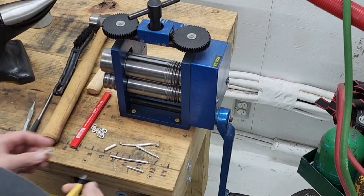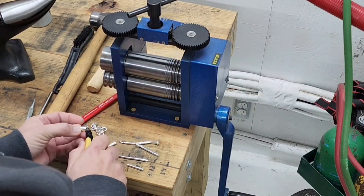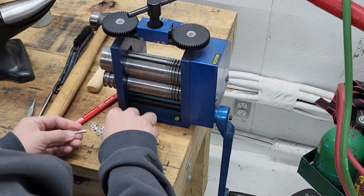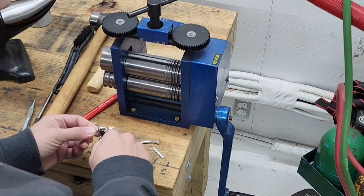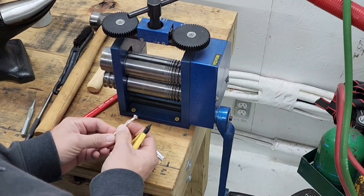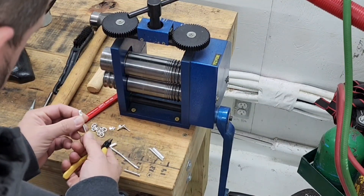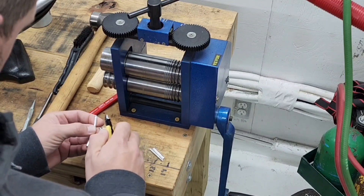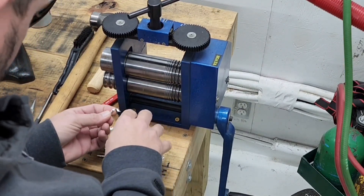These are the little bars from the casting. You've got to take your flush cut nips and cut off any of the sprues from the casting — or the tails, however you want to call it. Anything that's not of proper mass and size, you don't want to fight the rolling process. You don't want to feed irregular size castings through — it's just easier to throw it back in the crucible and cast another bar than try to roll a sprue.